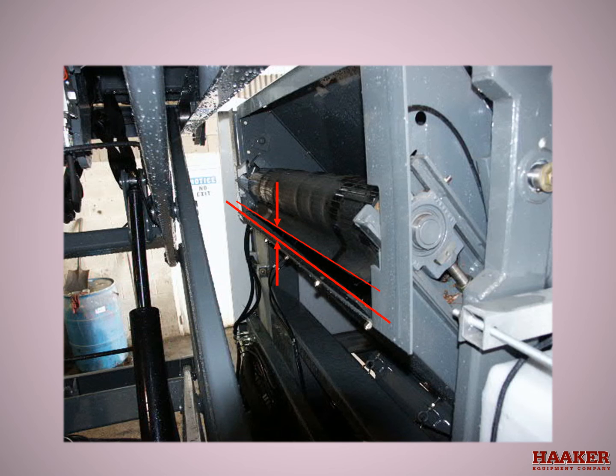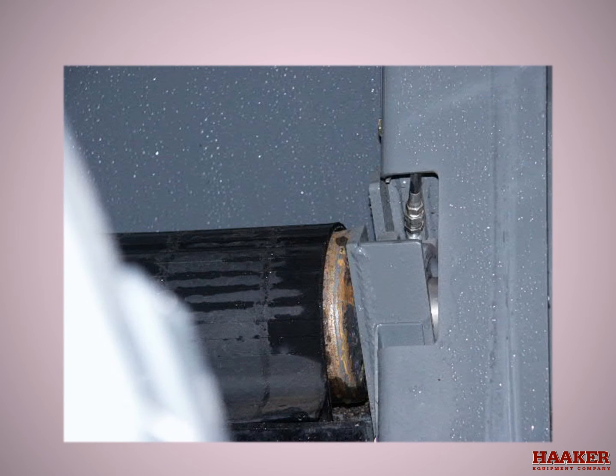You should have 2 to 3 inches of clearance between the cleat and the floor pan. We want the belt to run within a half inch to the left of the frame without making contact all the way down the frame. If hard contact is made at the lower edge of the frame it will tear the belt. If we can't get to that half inch at the top without contacting at the bottom, the lower roller needs to be offset 1 inch lower on the left side.